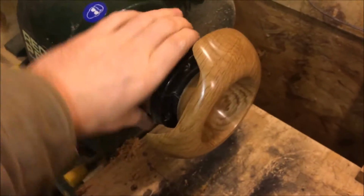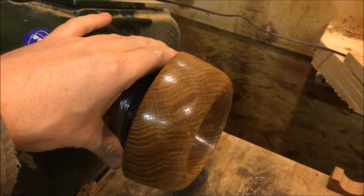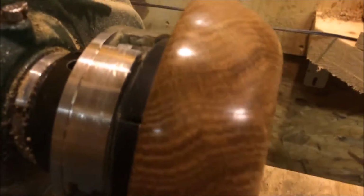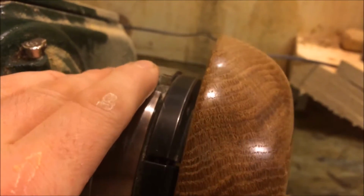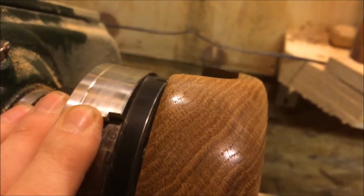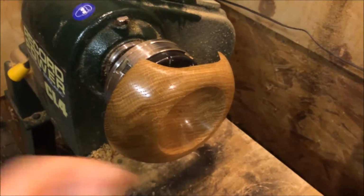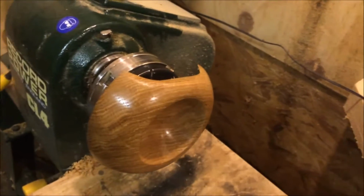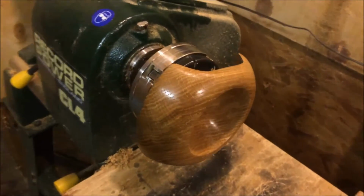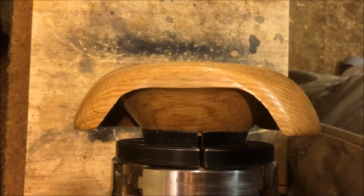Okay, there we go. Two coats of Hampshire Sheen, and it's lovely. Look at that. You can still see all the aspects of the grain, but you've got this beautiful sheen. Beautiful. So the next step is to make a curved jam chuck to go in there from this old chunk of oak. Flip it around and remove the bottom so it actually hovers off the surface. Hopefully, that's the plan anyway.